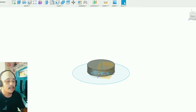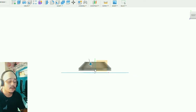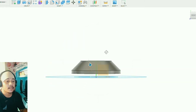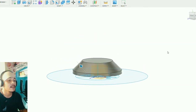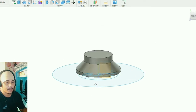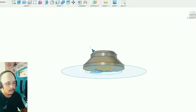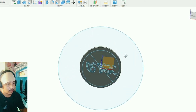I think I'd probably give it a 7 millimeter height instead, and then give it a chamfer on this edge. For those who don't have an idea, the 3D printer could support 45 degree angles quite seamlessly. It would not require actual supports for 3D printing the layers when it has 45 degree angles for its transitions. I give this a 5 millimeter distance. And then extrude this surface for about, I say, 3 millimeters? No, 4 millimeters. So it'll have a nice transition. Probably chamfer it again. Yeah. Millimeter distance again. Equal distances, height and depth.